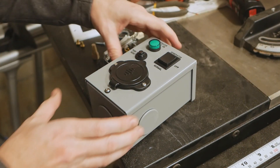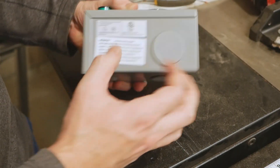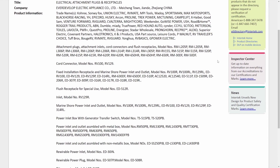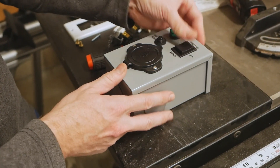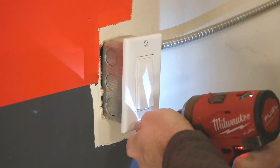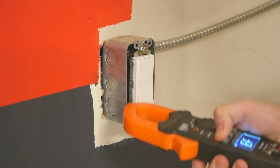I'll be using a transfer switch from Ever Develop Electric, sold under several different brand names on Amazon. It's an ETL-listed product, which is very important when installing anything attached to your home's electrical wiring. I verified this listing via ETL's website and am convinced of its authenticity. It has a normal off and generator power mode, and correctly disconnects one power source when switched to another. I'll place an associate link below.